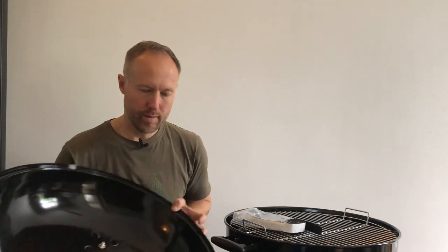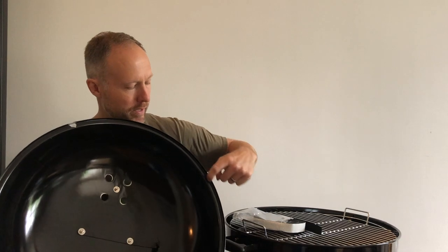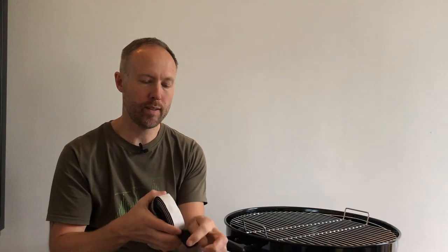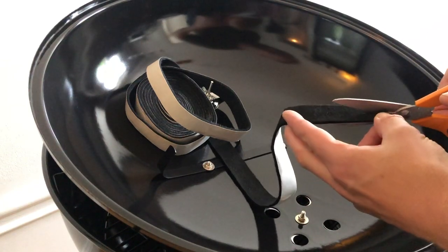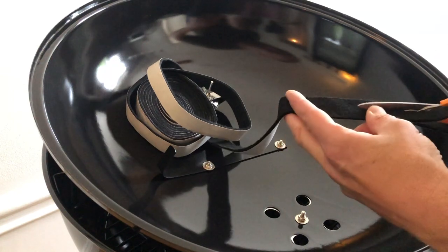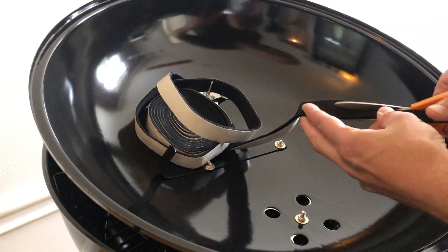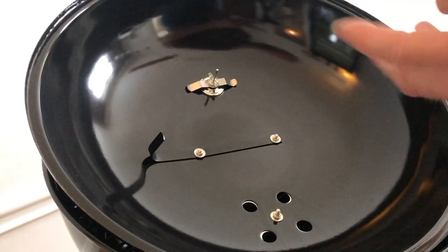Here's the lid, all brand new. If you don't have a nice clean lid like this one, you'll simply have to clean the inside first. We're going to mount it right here on this little edge so it rests firmly on the bottom half. This gasket is a bit too wide, but that's actually a good thing because I cut these in half lengthwise with a pair of scissors — that means I get two for one. Let's cut this one lengthwise. The length you need: the diameter is 22 inches times 3.14 — roughly three times the diameter.